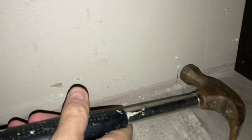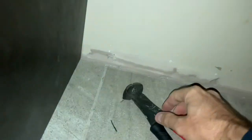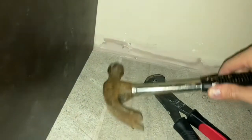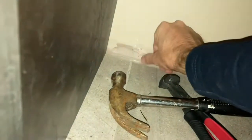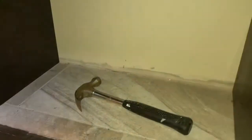So you could just pound them in. That's a possibility. Just say, see you later, forget them, and never see them again, right? Obviously, you run the risk if they're still there. If you go to reattach drywall, you might actually hit your new brad nail into the old one. That's a 1 in a million shot, but if you're using the same holes, something to be aware of. So you could pound those in, or I'll show you a couple little ideas on how you could remove them.